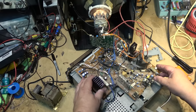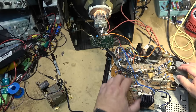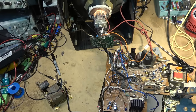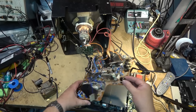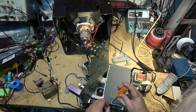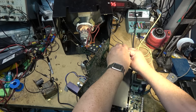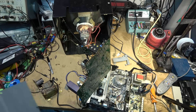Lift off that strap so I can lift the board out of the way, so I can lift the top cover away — so I can get to yet another cover underneath. This one has to come off to access the heads to clean them. You can't test it with it apart because nothing's connected. You've got to get under this cover too to get to the heads. The old stuff was built so much better than the newer stuff — and if you can't tell, I'm being sarcastic. I'm gonna clean the heads, and if that doesn't fix it, this thing's going to scrap.